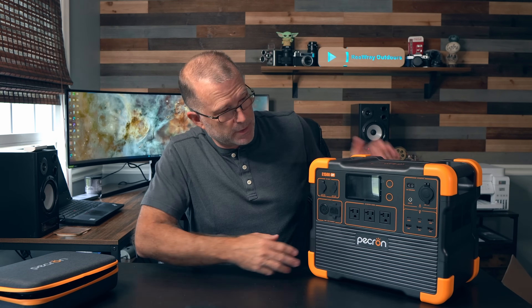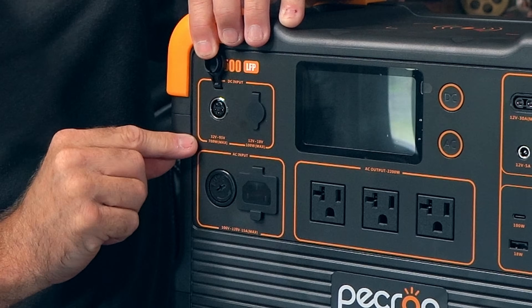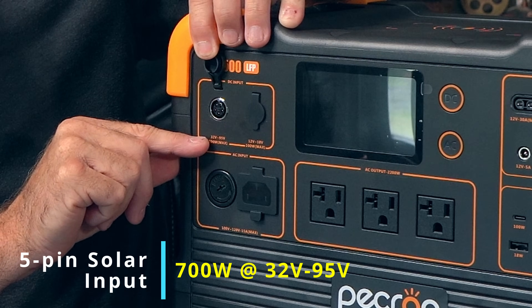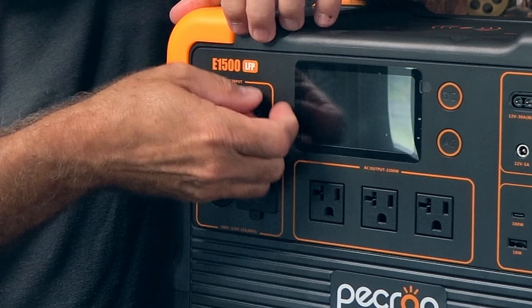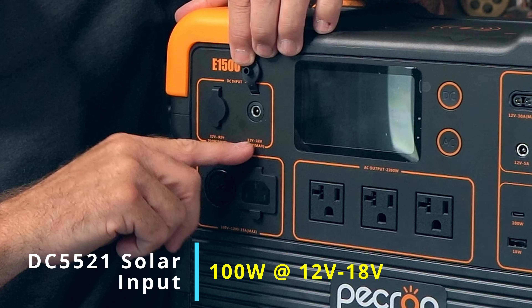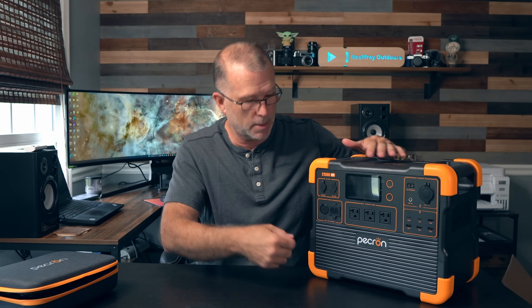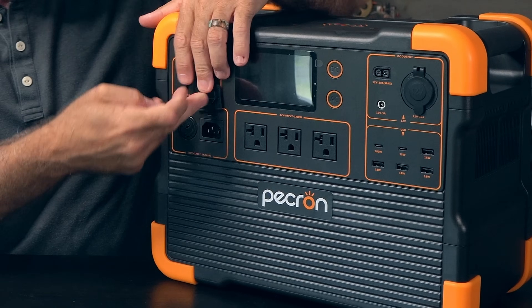There is wireless charging on top. You've got three AC outlets right here. These are the two inputs I mentioned — one that handles up to 700 watts of solar at a range of 32 volts to 95 volts; that's the five-pin aviation style input for solar. And then you could use a 100-watt solar panel on this one, or charge it from your car — this one handles between 12 volts to 18 volts, up to 100 watts. In lieu of that big monster commercial-grade AC adapter charge brick on the other models, this one you just plug right in and you're good to go.